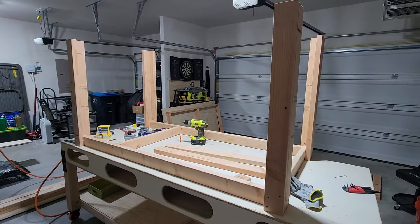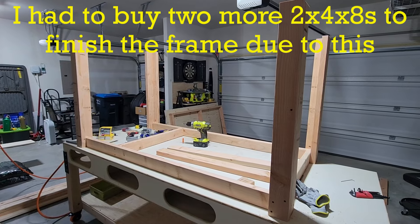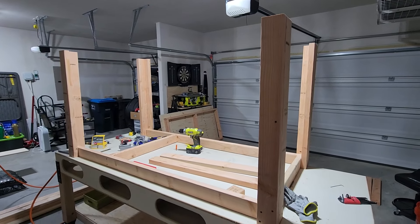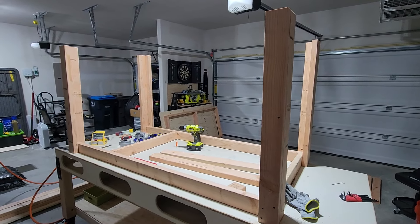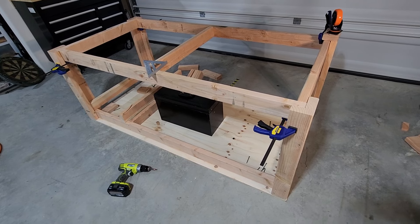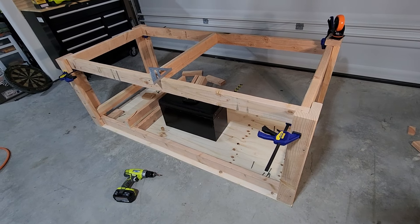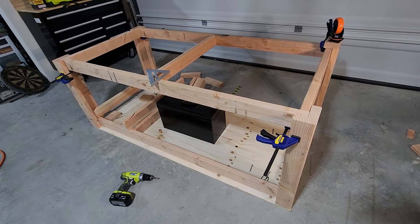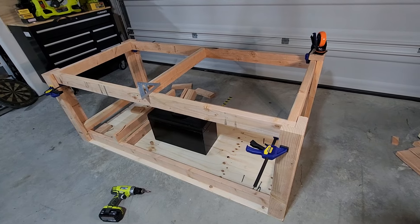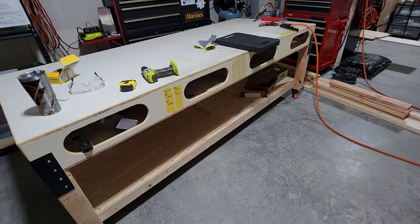The legs are all tied in together and I'm relatively certain that they are square and ready to be put together with the base. I have the basic frame complete — I trimmed my legs down to the height I actually want them. My table is hopefully going to be 35 inches tall, just a hair taller than I wanted, but if I need an even bigger table for outfeed I can put this one next to it, lock the wheels, and use it as well.